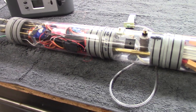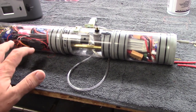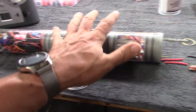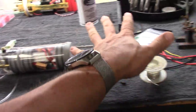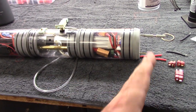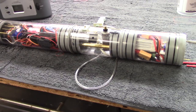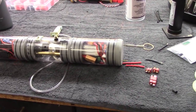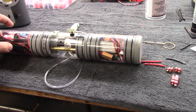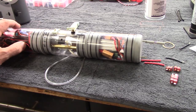When you get the cylinder, you'll see three evenly distributed compartments — about a 12-inch motor compartment, a 12-inch ballast compartment, and a 12-inch battery compartment. With this new setup, it completely comes apart at every joint, so all of that plastic tubing is completely separate and segregated. You can cut it to perfect size. When you order it, the motor and battery compartments are standard at two and a half inch diameter.